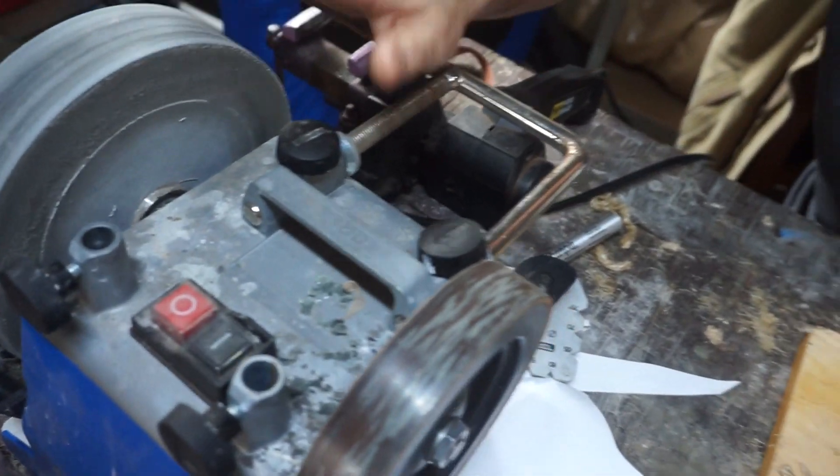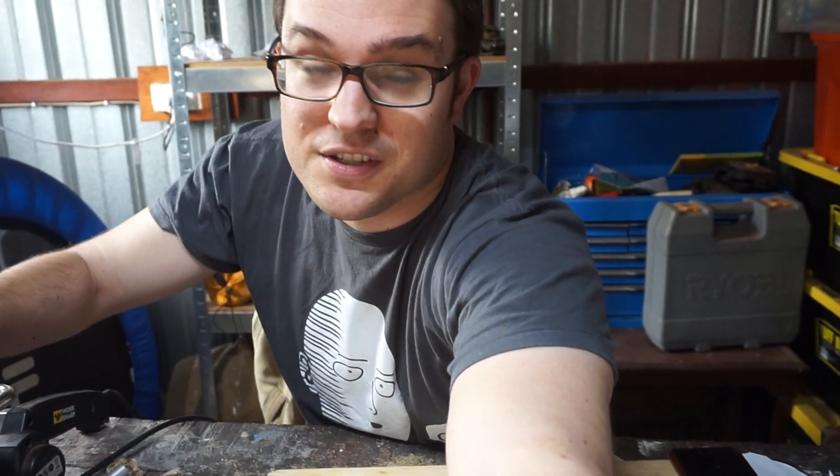Vanax definitely does seem to have a fair boost on the LC200N/Z-Finite so far. So that's the first part of these nitrogen videos. I'll get to the second part when I can get more rope. Because I'm using the KME now, my arm gets a bit sore more quickly. We're going to continue testing with polished edges next, then do some impact testing, and then go to the max with old mate Tormek McGee here — putting some crazy extreme edges on these steels and seeing how they go.